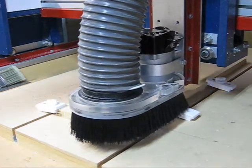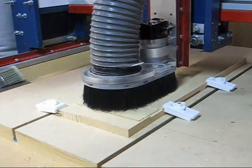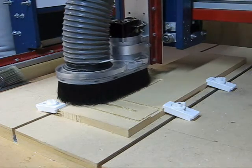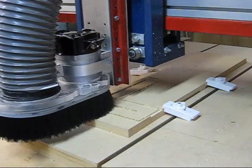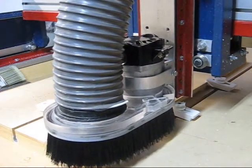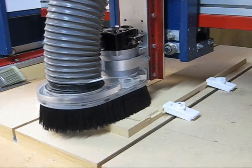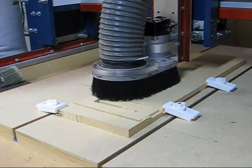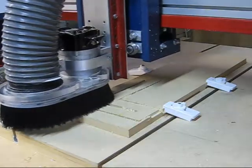The first part of the cut there was an L-shaped slot. It cuts right through the material, down to the table surface. Because I zeroed off the table top, it will only just brush the table — it won't cut into it. The profile cut I'm doing here is only cutting down to 17.5mm, leaving at least half a millimeter of material, which will hold the part in place.